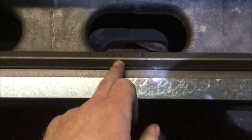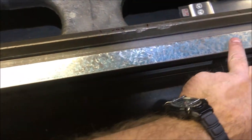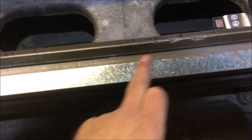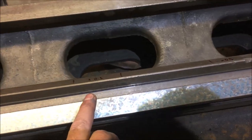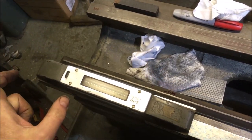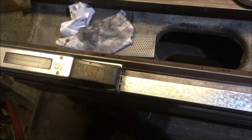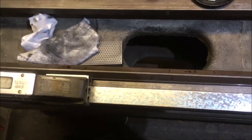And then I've got another drop again. Sorry, then I've got a reversal of that. So basically in this section here, I've still got something in the region of 2/10 worth of wear that I've not taken out. And there's a little jiggery pokery on the end here, whereas there's still 2/10. So I'm going to go over and refine it again and keep doing prints on it, but making the prints lighter and lighter. So if you look, that's the kind of surface we've got.